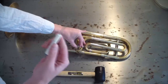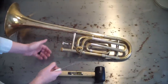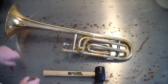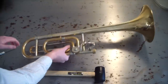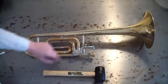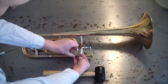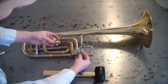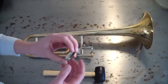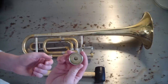I usually have to use a screwdriver for leverage — you probably shouldn't do this, but I do. Put that off nice and safely; you don't want that to bump around. This is where the spring is on a Bach, so if you let it go, it'll smack into your back plate. Flip that guy over. The annoying thing about Bach is that a lot of times the lever will get in the way of this, but on this one it's actually almost out of the way. So we unscrewed this, keeping the lever out of the way. Here's one of the main parts of a rotor valve: this end cap, which basically just seals in the back of the valve.